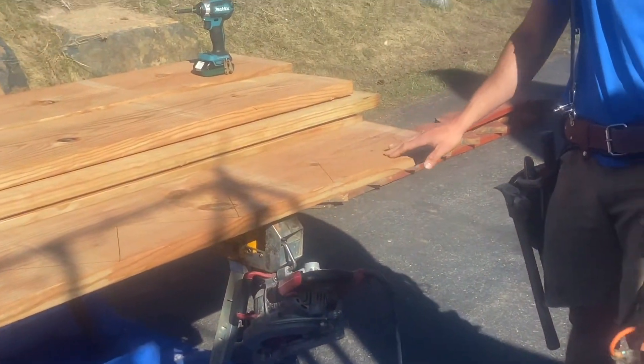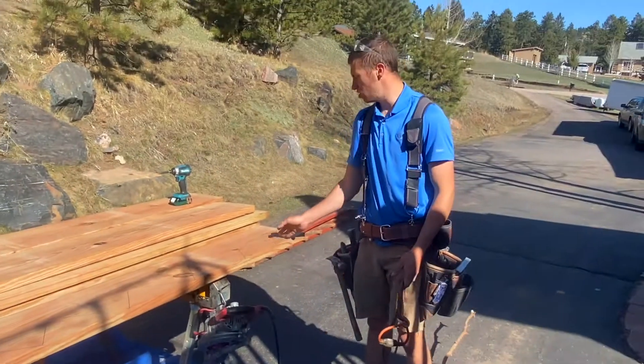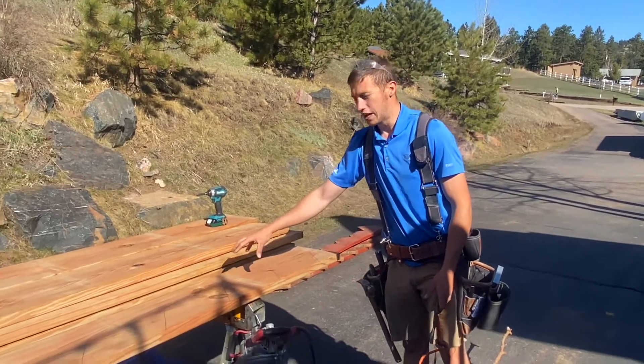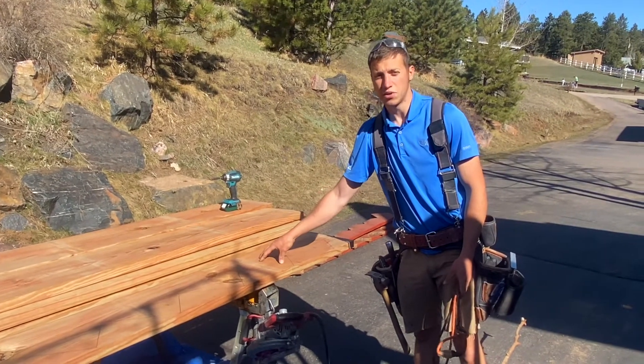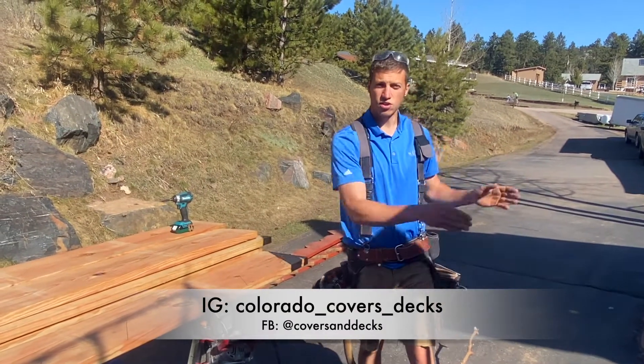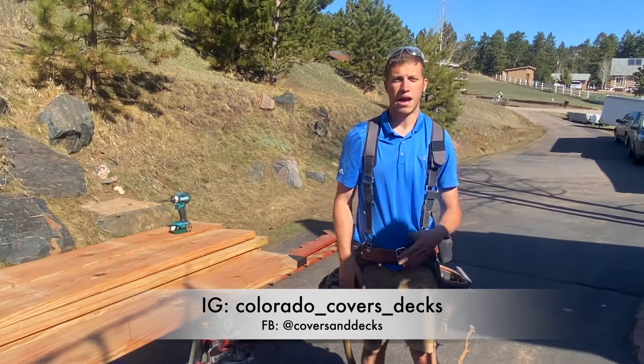Since it's an old stringer, the lines aren't perfectly straight. So what I'm going to do is when I make my cuts, I'm just going to make sure my cuts are really straight. And then I'm going to use this board as my new template, scribe that onto all our new boards, cut six more stringers, reset them, center them, and lay them back out.